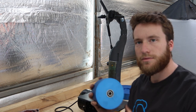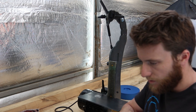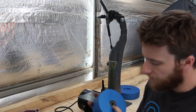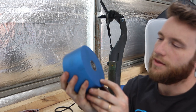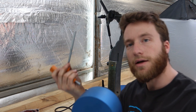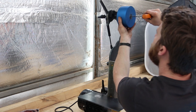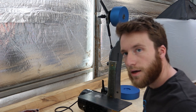Careful you don't drop these wheels. They are expensive and they will dent, but they won't break. It'll just be cosmetic. All right. Now this does have a spacer. You won't be able to see that, but when you've got yours, there's a spacer that sits between the bearings. If that's sitting down, we'll just need to use something like an Allen key. Just pop it in from the other side to lift it up. And that will slide just over our axle, like that.